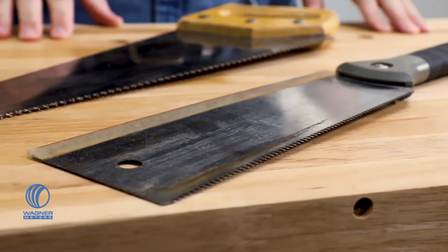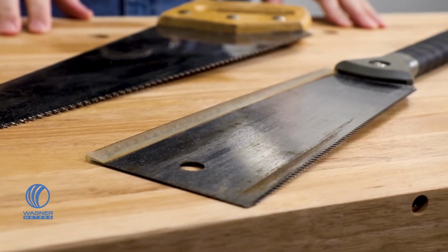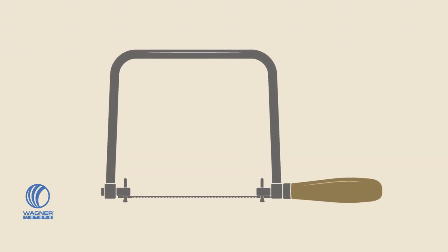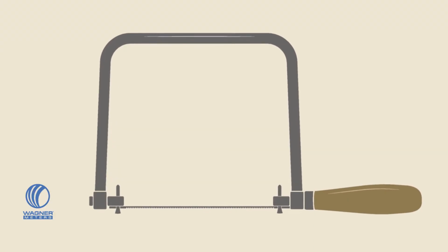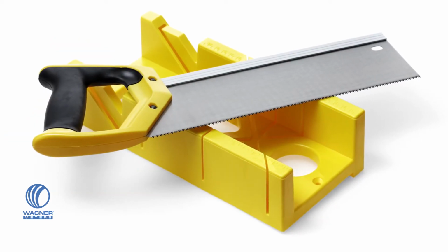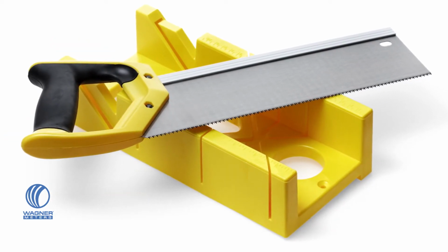For general use, start out with a fret saw for woodworkers. It's like a coping saw for wood. You need a mini saw too for areas in which a chisel just won't work. Then a good tenon saw should follow, along with a miter box that you can use with the tenon saw. Other saws, with their variety of cutting surfaces and angles, will come as the need arises.